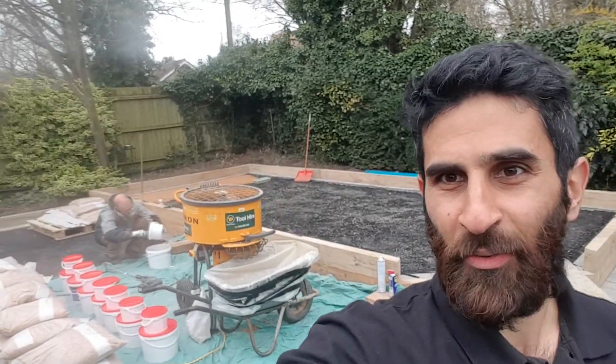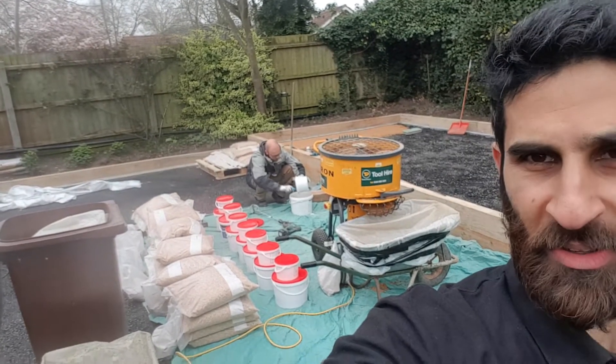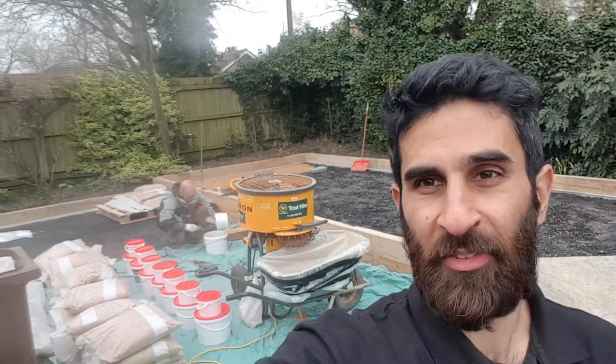We'll have a quick chat about the resin bound — I'll be walking backwards very slowly though. So we've got the mixer going, we've got our kit all in order of our mix. It's very important that we're very disciplined when it comes to mixing this, as it's very dependent on the ratio and each single drop of hardener along with the resin, along with the gravel and the sand and on and on.